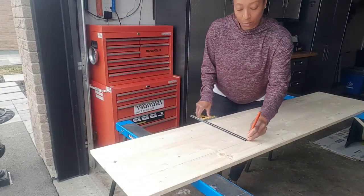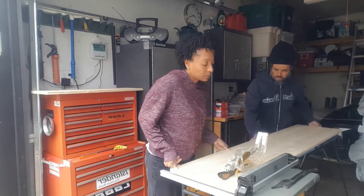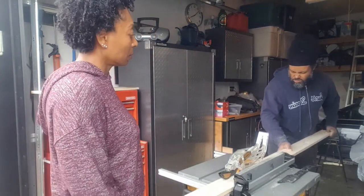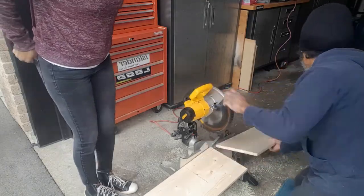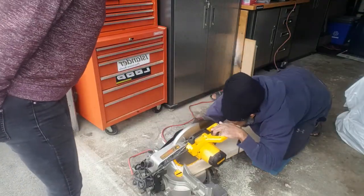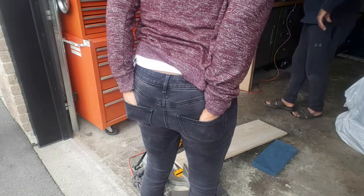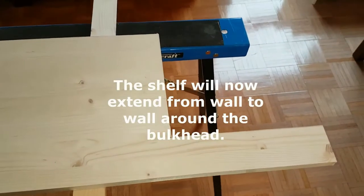While the compound is drying I can focus outside the closet and get the shelf measured and cut, and also measure and cut the shelf supports. Remember I mentioned figuring out how to work the shelf around the bulkhead? Well, what should have been two simple cuts took some maneuvering since we were using a miter saw — that's not the tool you want here. A circular saw would have been much more appropriate and would have saved a ton of time. But it's done and this is what the shelf looks like.